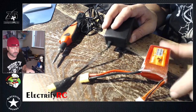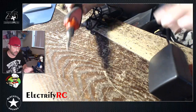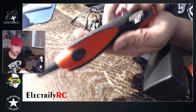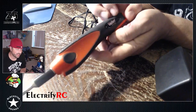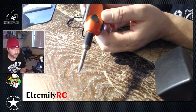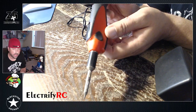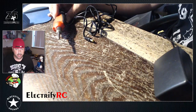So we have a 3S LiPo and the wall plug that came with our Weller WPS 18MP. This is a horrible iron to be working with as a main iron — very, very bad. It's only 18 watts, and if you don't understand what wattage is, you need at least 30 to 40 watts.